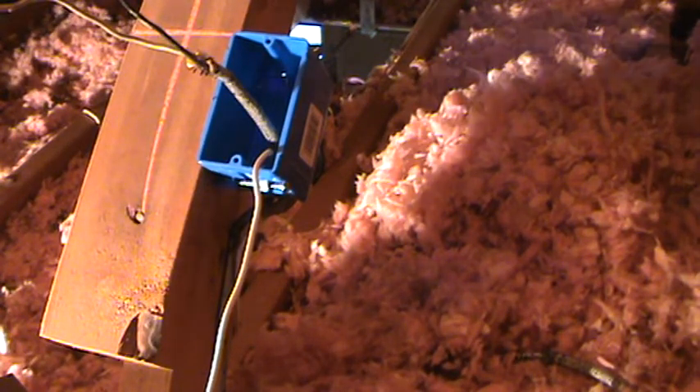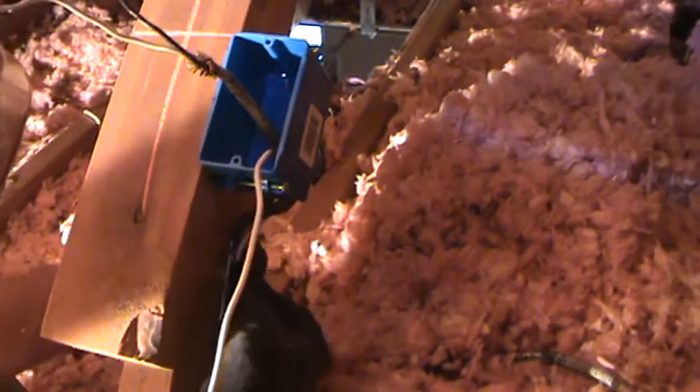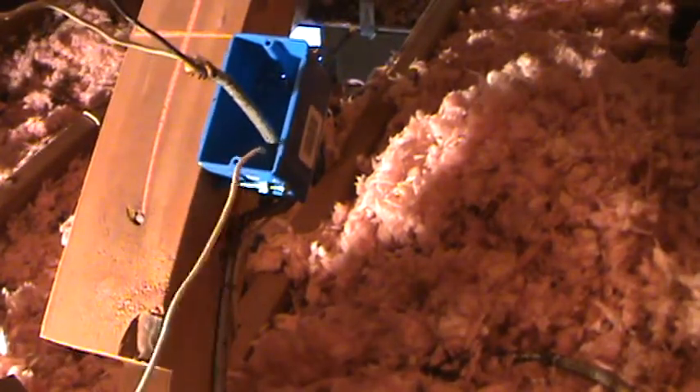Now I can just put another staple in over the top of that — just want to make sure you don't staple it too hard. Snug as a bug in a rug. See, I daisy chained it over there — up, down, up, down — on over there, so if somebody walks on it they're not going to trip on it and it's going to be below the insulation line. I pulled a lot of that blown insulation over here; when I get all done I then have to, one handful at a time, reposition it back in here.